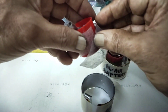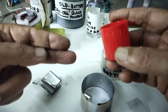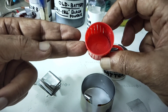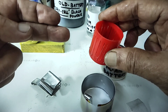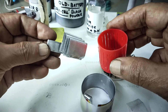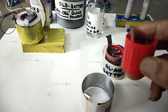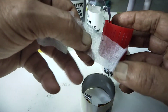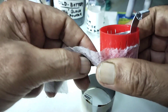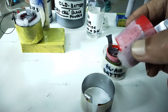This is a cap — actually a spray cap. By using a heated metal I have made a slot like this. You put in this slot and you can see the openings from inside, because the electrolyte should pass through both electrodes — positive and negative. This is the aluminium sheet; you can cut any design, even spherical, and keep it inside. For safety we put a filter because contamination will go inside. Any filter cloth available — mask material, whatever — as long as it can withstand the caustic solution.